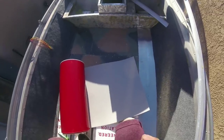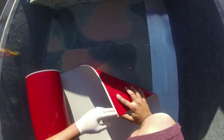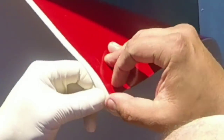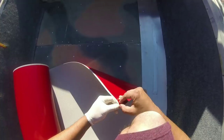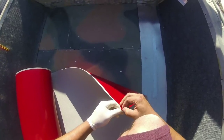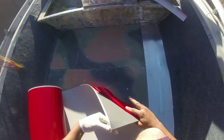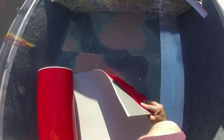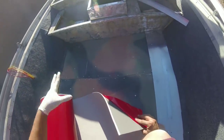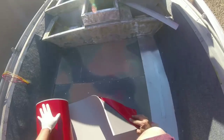Right here — when you get a roll or strips, it'll have one section where there's no adhesive, and you want to hold that section and peel back part of the adhesive. This is 3M backing — very strong. Once it sticks to aluminum it will never come off. And somebody asked me if this can go onto wood — absolutely, with an adhesion promoter, or if you're resin coating your deck and apply this right when the resin is thickest and stickiest, it'll solidify in and will legit never come off the wood. It'll rip the wood face off before it comes off.